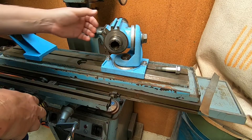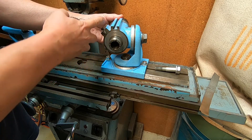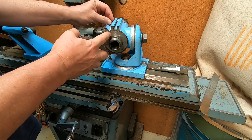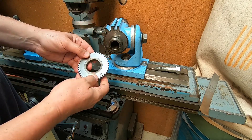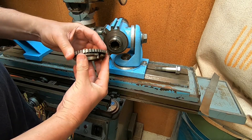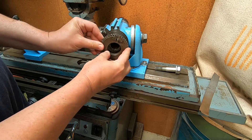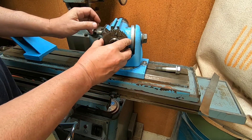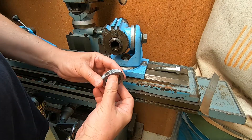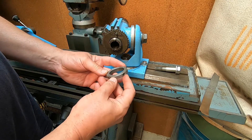Looking at the back end of the indexing head, there's a body that runs through the external barrel with ball races at both ends. This toothed index ring sits on a carrier, fits on like that, and is in turn held on by a lock ring. This one's rather mangled, so I might yet make a new one.